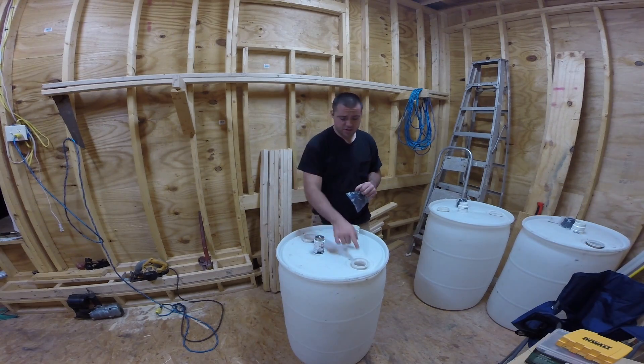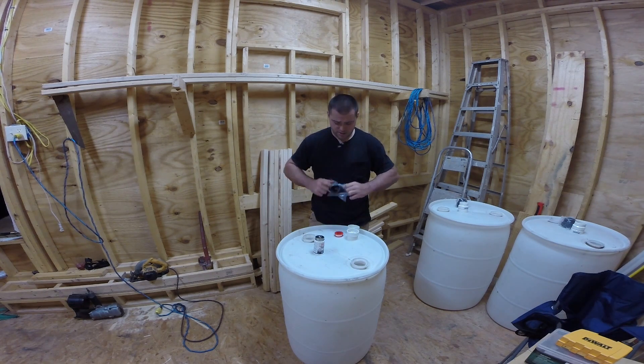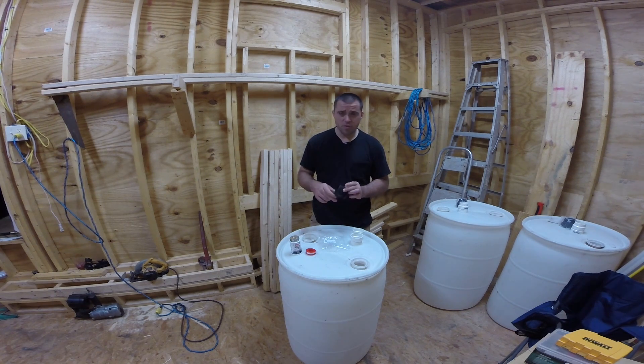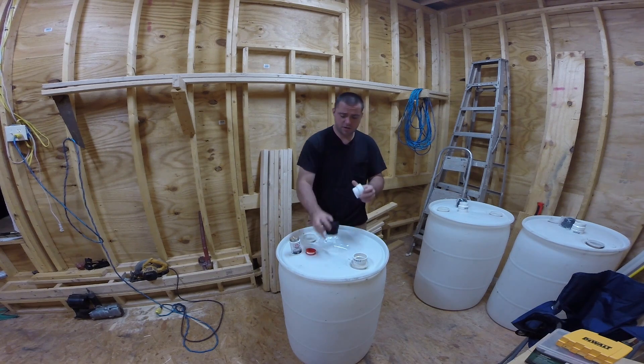I'm going to install the adapters onto the tank, mount them in place, and then run the plumbing into the tank. This adapter I bought — the model number is S64x5 male drum thread to two-inch BSP female — they're only five to six bucks each, and the link will be in the description below. I've got two-inch smooth on the inside to two-inch threaded male, which will screw in here.